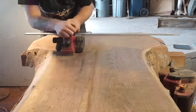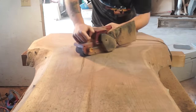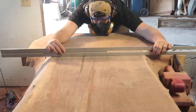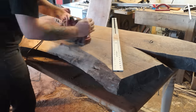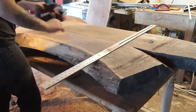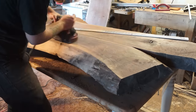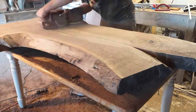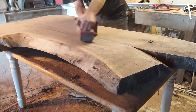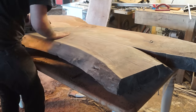With the glue and epoxy dry, it was time to flatten the slab. There's really no easy way to say how to do this — basically you get a straight edge and take down any high points, first with the hand plane and then with a belt sander. I used the hand planer to take down the really high points, and then for any of the smaller, more subtle things, I used the belt sander because it's not as aggressive. Once you flatten the top, all you have to do is flip it over and flatten the bottom as well.